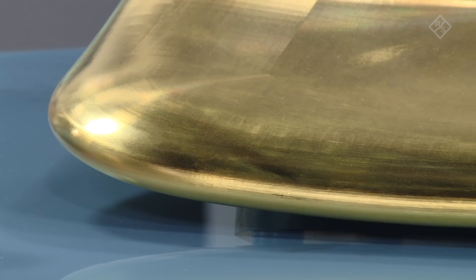What I see here on our reflector compared to others in the industry is that we have rounded edges. Why is that important? The size and scattering of the shape determine the quality and size of your quiet zone. If you have very sharp edges, you start to diffract some energy, which creates ripple and reduces the global size of the quiet zone — meaning you can only test smaller devices with high accuracy. To avoid these discontinuities, because electromagnetic fields don't like discontinuities, you have to have these very round edges where currents can flow smoothly and scatter energy to the back part of the reflector, not impacting your DUT.